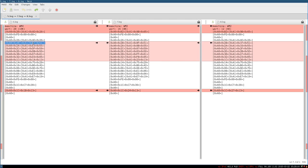I'm not sure if this is some kind of encryption security or if it's just to have redundant data and to check if there is an error on the card. But you see this pattern. You can see it here again. Here there's a decrement by 4, and here there is an increment by 4 when you increase in the address range. So that's the first point. We know that only this value is important.